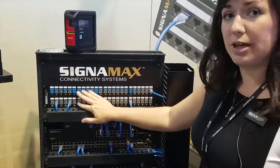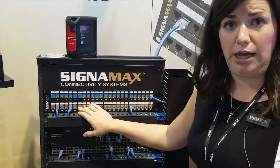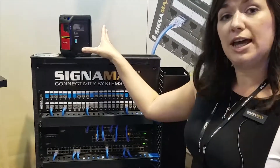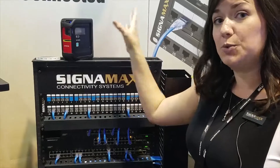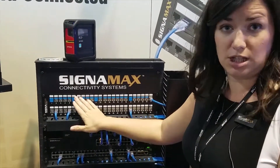We're going to focus today on the patch panel up here on top. This is a 48 port patch panel with cat 6a screen jacks. The Epson printer has all of our templates in it so that you can create easy readable templates and labels for all the patch panels in the telecommunication closet.